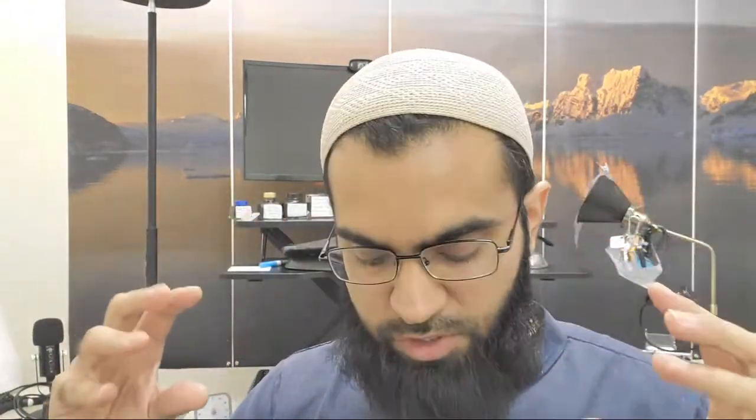So one reason you need to clamp your transducer, or mechanically attach something to it, is that you need to hold it somehow. Even if you have a piezo buzzer inside a plastic housing, you have to hold that buzzer somehow. You have to put in an O-ring or some type of epoxy to constrain it. You can't just have it dangling off in free air. That's not much of a device, honestly. So you need to actually contain your device to be able to use it practically. And also, if you want to have some directionality, you would also need to hold it. So that does make sense.